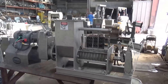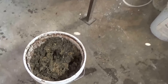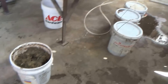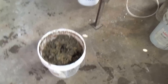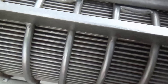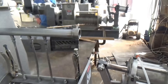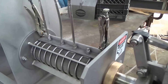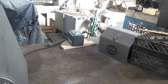This is the 18th of December 2013 with Vincent Corporation. We have poultry manure here — four pails of it. We'll start out using this little four-inch press. The openings on the screen are 15 thousandths of an inch, 350 microns. It's set up for steam injection. We have a boiler over there but we don't anticipate putting steam into this press. We have a VFD variable frequency drive to run it so we can change the speed.